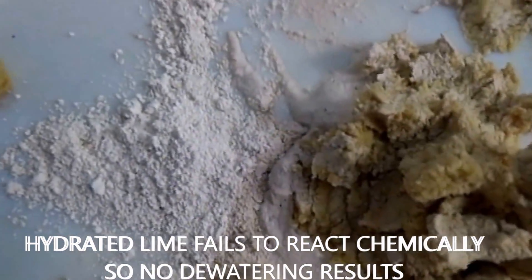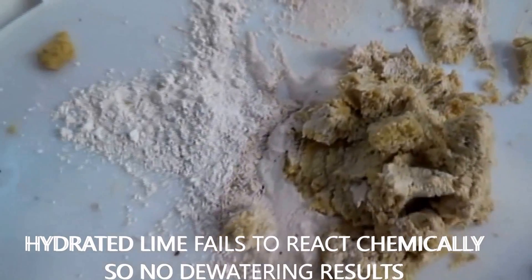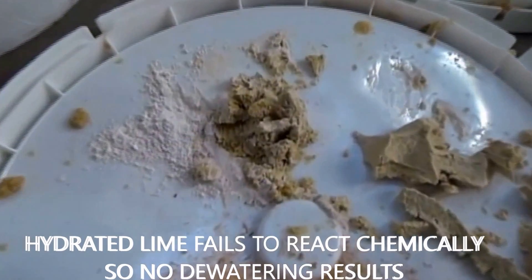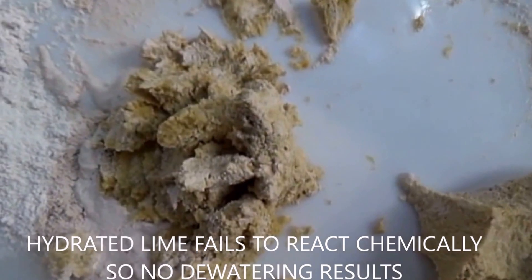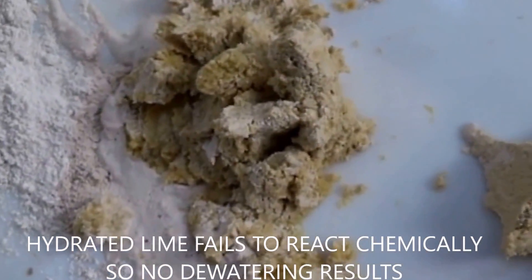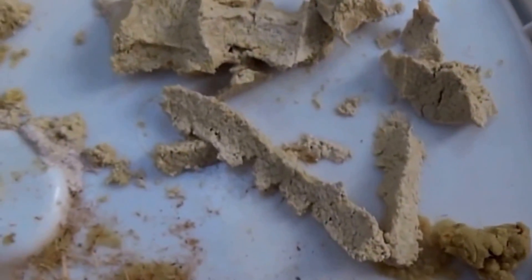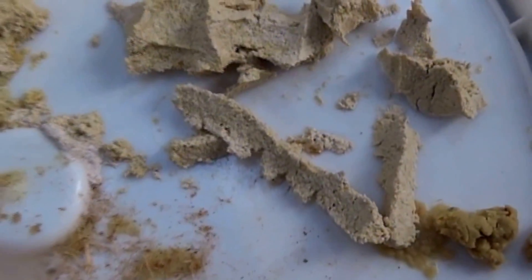Here's something else — this is hydrated lime. All the citrus feed mills in the world blend hydrated lime with orange peel to make it pressable. You can't squeeze water out of orange peel unless you mix hydrated lime and get a reaction. So we mixed the hydrated lime with this material, gave it 15 minutes. It takes wet hydrated lime and orange peel blended for a chemical reaction, then you squeeze it and get a stream of water out. What came out of my hand was no water — just an extrusion like mashed potatoes. So hydrated lime with the taco waste does not work.